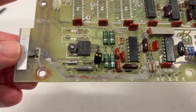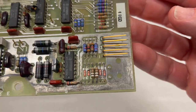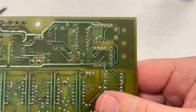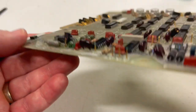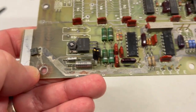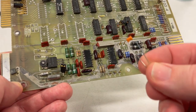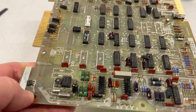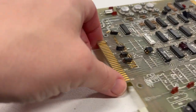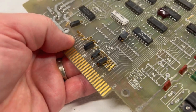Okay, here we are. Of course it's not going to look perfectly new, but the corrosion is gone, all the traces seem to be clean, there's nothing shorting out against something else. May not look pretty, but let's see. We've already got — even cleaning it — this capacitor is already broken off. I have a replacement; I believe it's 0.015 microfarad at 50 volts. I'll be replacing that. And the pins — I've noticed there's some that might stand up, but I've also noticed some that have a crack in them already before they're even tried to stand up.